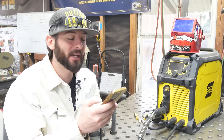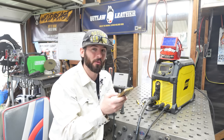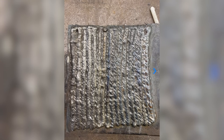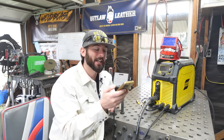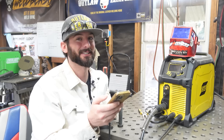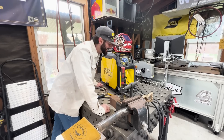He's having a good time with the MIG introduction process, running beads on plate with overlapping welds. While it does look like your settings might be appropriate, WizBoy, you've got some serious issues in this weld — a lot of overlapping problems, valleys, undercut, and inconsistency in those beads with your travel speed. Overall, you should be proud of the progress you've made, but I would not be proud of taking a grade on this just yet.